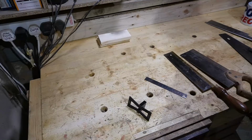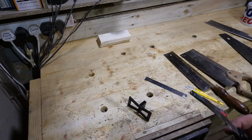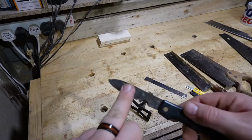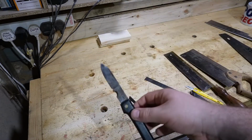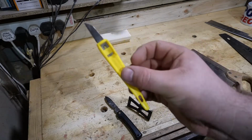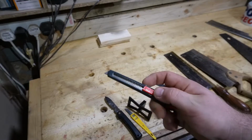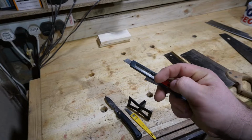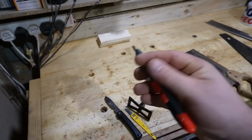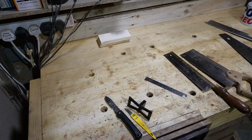With dovetails, it is vital to have a sharp edge. So what you're going to need is something to scribe a knife line. This is actually a pen knife that I shaped into a marking knife. I've been using this as a marking knife for too long. But you can also pick up these cheap disposable little scalpels, or even one of these little breakaway craft knives. The key is it needs to be razor sharp and thin, so we can get in when we're marking our joints and cut exactly to those razor lines.